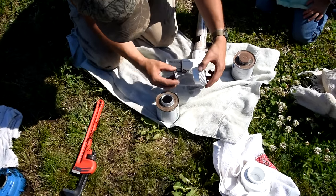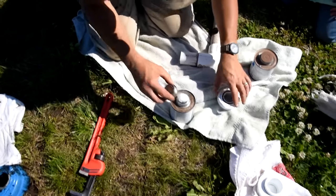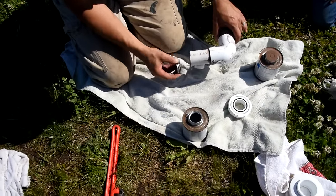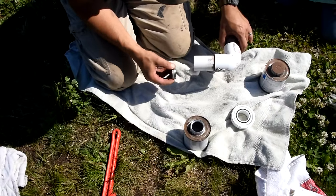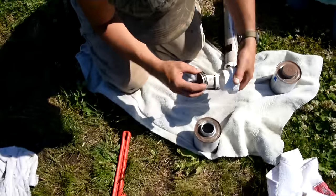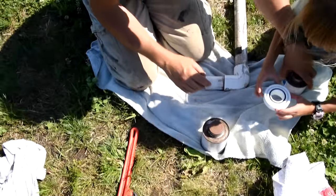I'm going to use a two-part PVC industrial-strength cement to glue this new fitting on. I went with a slip-slip but it's a threaded union in between, so in the future I'll be able to just unthread it, grab the rope, take the cords out of the outlet, and pull this whole thing up — and I won't have to cut the pipe like I did this time.